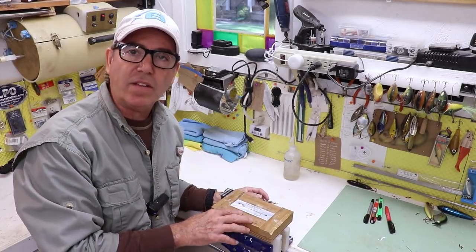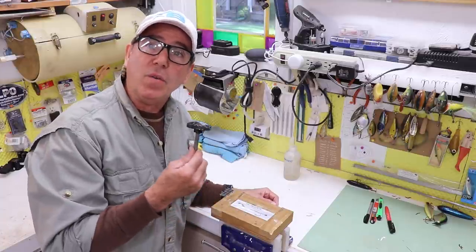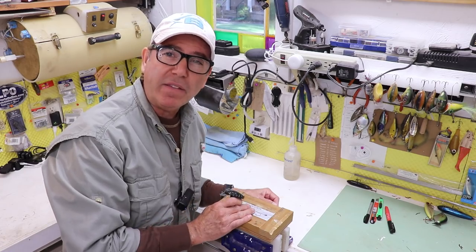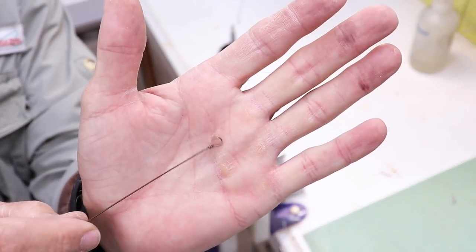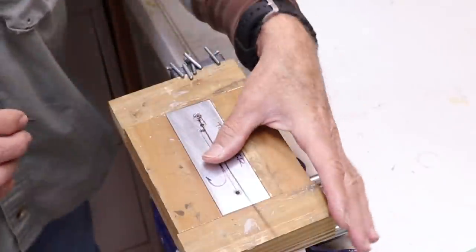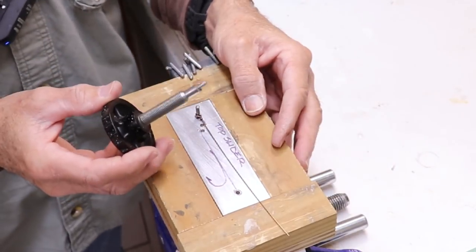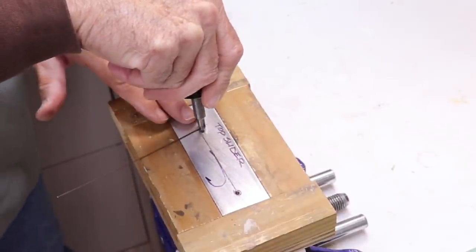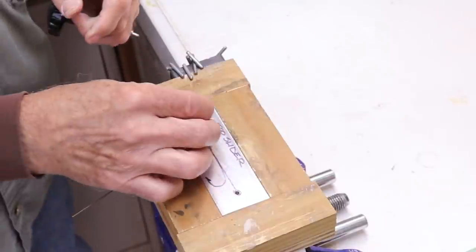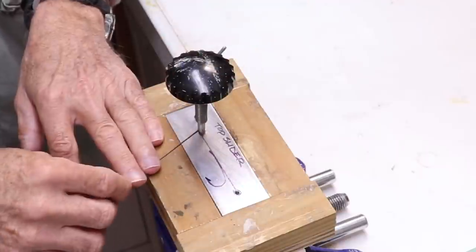If you haven't seen me make these wire harnesses on this little bending jig with my bending tool, I'm going to go through it — though you can watch a much more thorough video on how I made these tools, and I'll put links in the description. I'm starting off with a wire that already has a little twisted eye on it. I'll align that with the first hole on my jig, stick a pin in it, then take my bending tool, stick it in the next pinhole, and create the first bend to align with the drawing on the jig. Stick a pin in that hole and continue repeating that along all the holes on the jig.